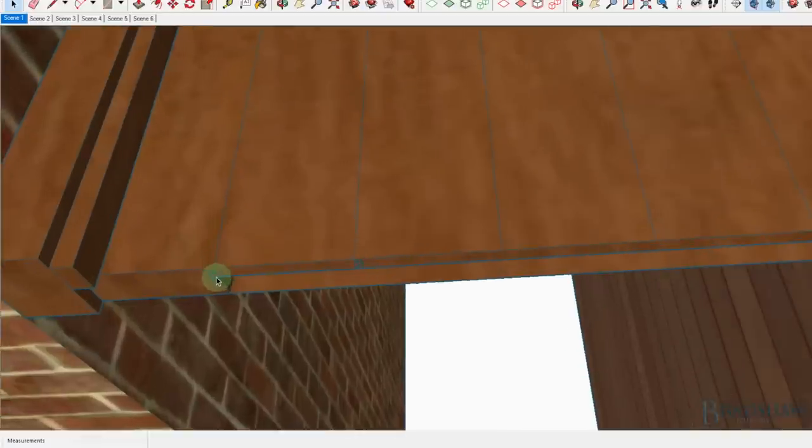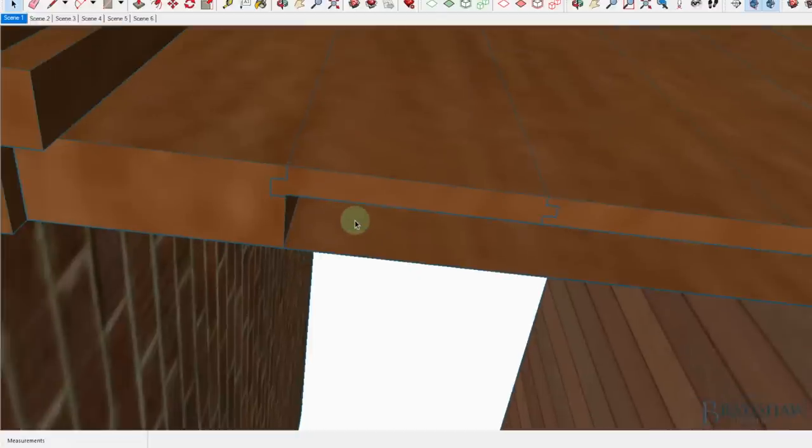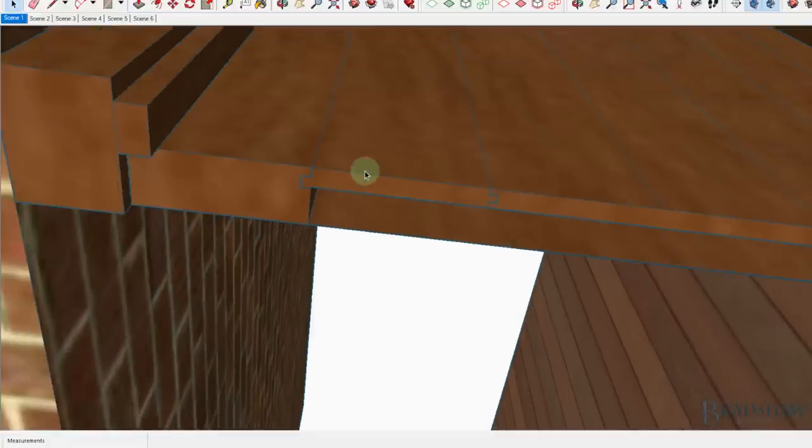You have to be a little bit careful with that if you're using my method of fixing the boards, because you lose quite a bit when you machine one of the boards in the end here, because there's a tongue on one side and a groove on the other side of the board. So you're losing about 7mm each time with them two machining. So whatever finish width you want your board, this is 120mm, you're going to have to allow for that 7mm either side, as well as the physically planing it up to get it straight. So you're going to be about 20mm bigger rough sawn size than your finished board size on this particular board here, so just be careful that you can actually get that board out of the timber that you've got.